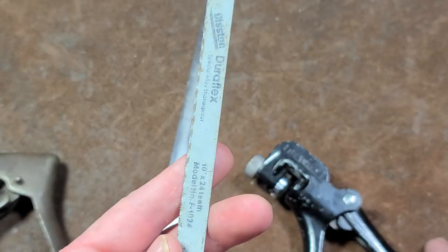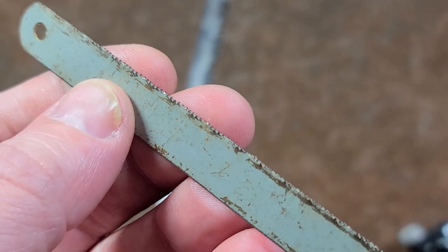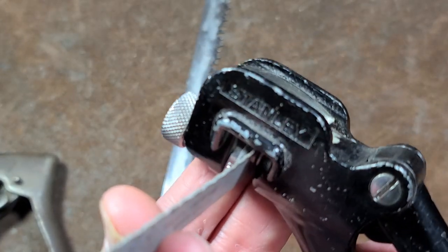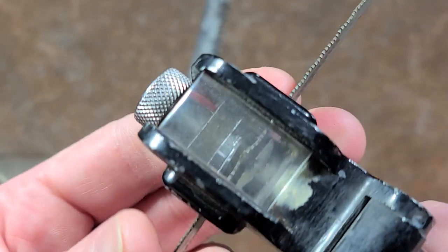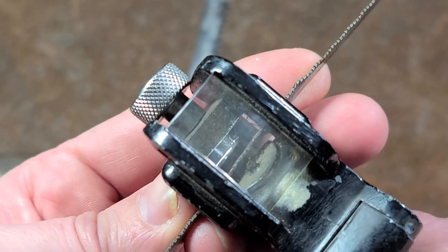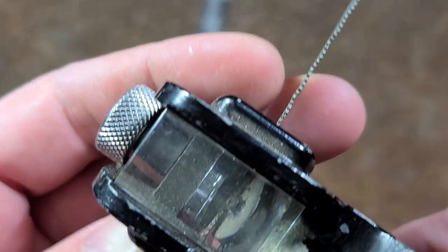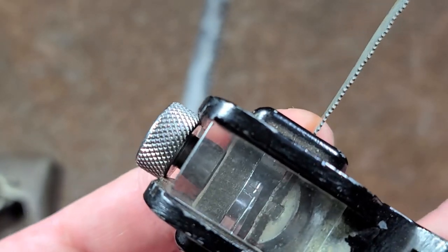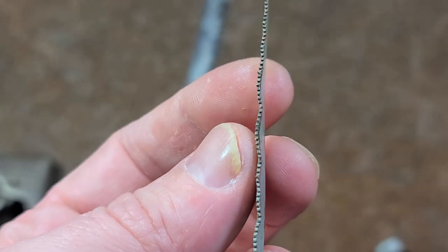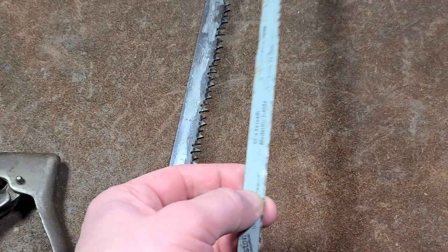I had an idea. This is actually a Disston blade — they make pretty nice hand saws. With hacksaw blades, they're more corrugated because the teeth are so fine that instead of offsetting individual teeth, they give it a wave pattern. I was curious if you could use this tool on a hacksaw blade to add a bit more curve — and oh yeah, no problem. You go along the blade, it bends it up a bit, then flip it and go between the individual areas the other way, and you can give it a bit more wave so it cuts a wider slot and your hacksaw blade won't jam up as much.